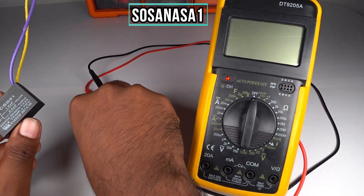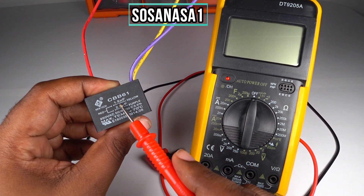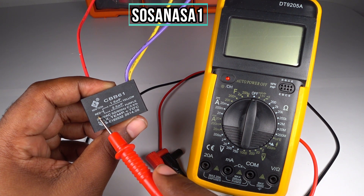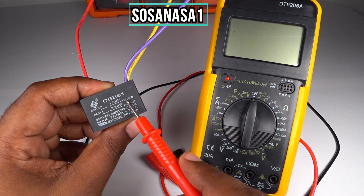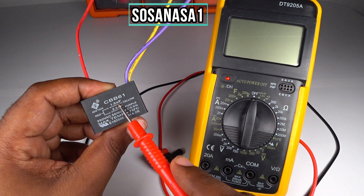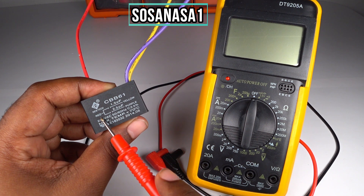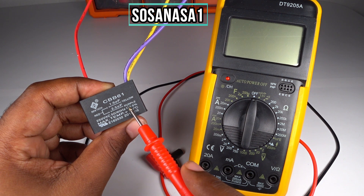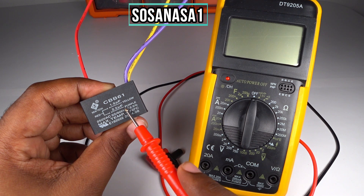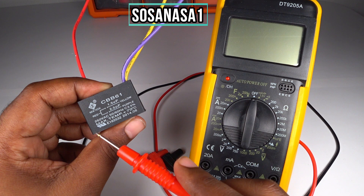And all the way, watching on this area: the combination of the red cable with the yellow cable has 1.5 microfarads, and the combination of the red cable with the purple cable has 2.5 microfarads. Now we are going to measure how many microfarads this capacitor has using a digital multimeter.